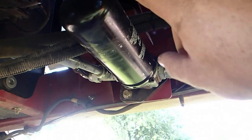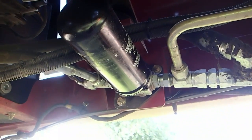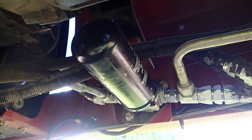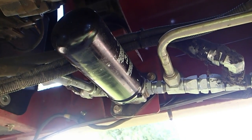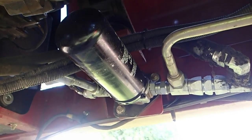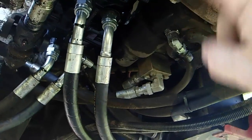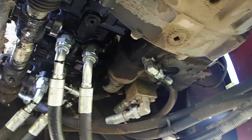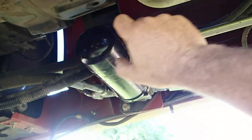Now they're telling me that this thing being an inline filter, it should have caught everything before it ever went to the pumps, if I'm correct. Which doesn't make sense. No, it can't possibly. It has to go through the header drive motors, because that's header drive. So it's got to go through the header drives, and then it comes back around and goes through this filter before it goes back into the header drive pump and the steering pumps. So technically, I guess I could run the machine until it completely failed and be safe with the motors, but I'm not going to risk it.